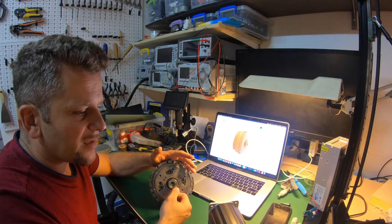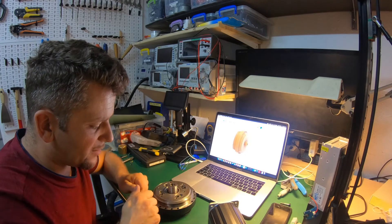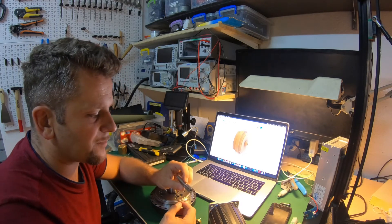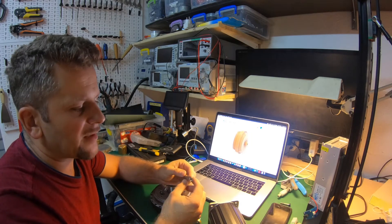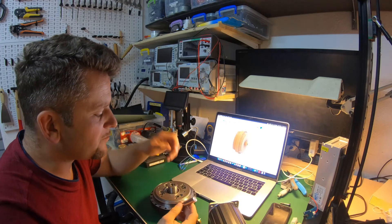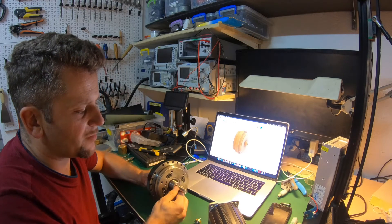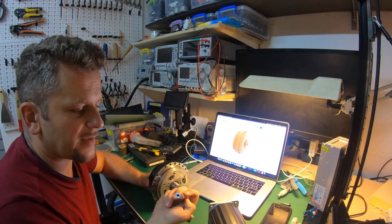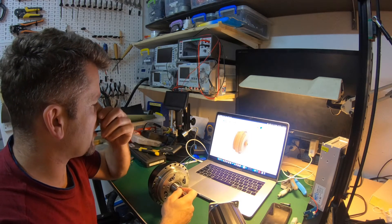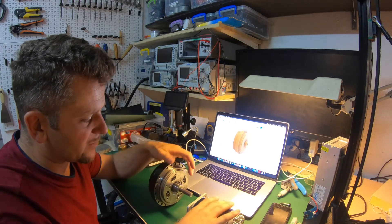In order to avoid that problem, another idea was to cut a spline shaft. Using a 14 millimeter steel shaft, I cut splines on the rotary table I already have — the fourth axis that has backlash — and this fits perfectly here. Basically I'm able to couple them together. This end is threaded, and I'll be able to screw it in from here and fix them in place so there won't be any play. Now I'm going to have to order a coupling and attach these two with it.